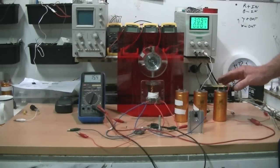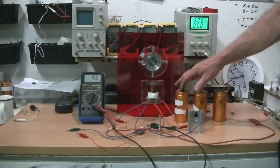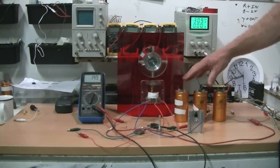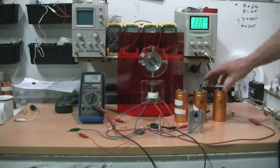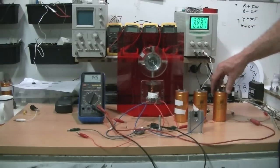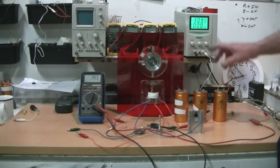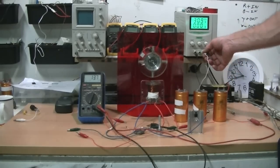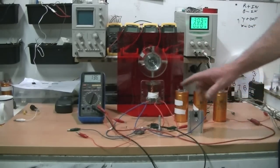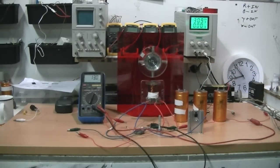So what we're going to do is use 2 as our run battery and 1 as our charge battery. However, one of the 2 that we're using for our run battery is going to be flat, and the other one we're going to put our 30.5 volts in. My meter says 30.9, but it's actually only going to be 30.5 because that's a little bit out, because I didn't have a diode on the positive side when I was running my twin back EMF system off here, and it's upset the apple cart in there. So my stupid fault, but things happen.